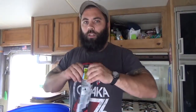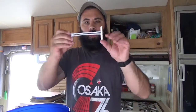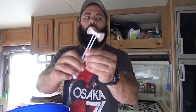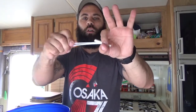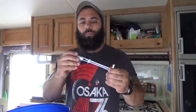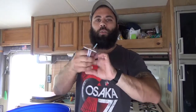These are called toggle bolts, and you're like, well they're just going to fall in. Not necessarily. How these work — these are really for like drywall or just any sort of hollow wall kind of thing. Here's the hole, and then you twist it back out, and then you slide that thing forward and it holds it in place, ideally. But normally what's going to happen is it's going to hold it in place just up until you put that bolt in, and then that's supposed to just stay there forever. If you take this screw out, this dude will normally just fall right inside the wall, so it's kind of a permanent thing.